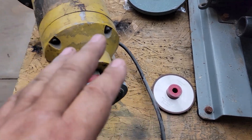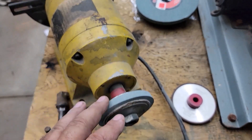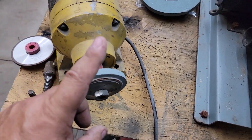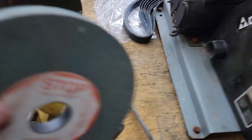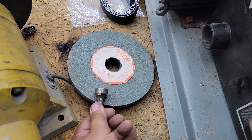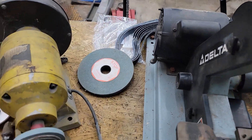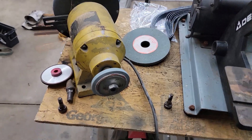With the diamond and drill press method, there's much less mess in the air. You can even squirt a little water onto the diamond wheel — but you cannot get any water on the green silicon carbide wheel. Also, on the green wheels, you cannot grind on the side — they have a tendency to fracture and break. These are cheap; I'll put a link for them in the description.